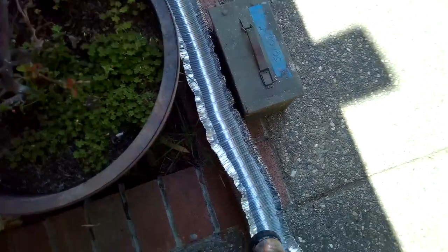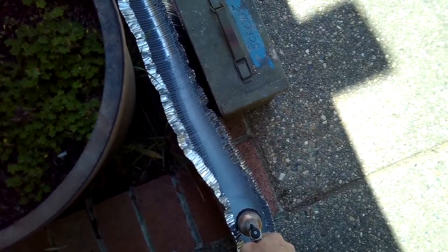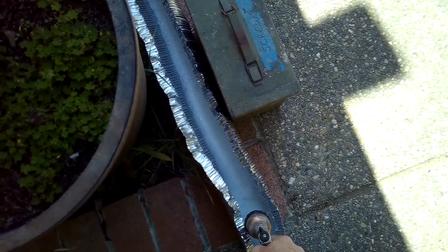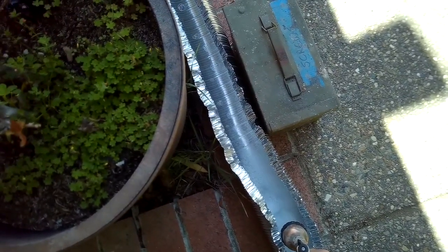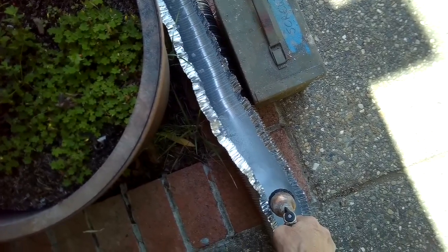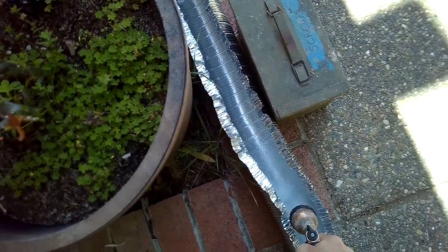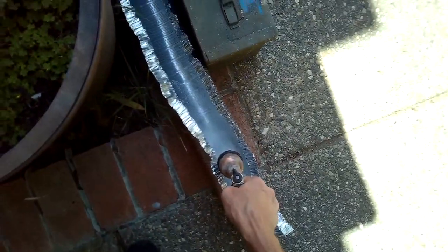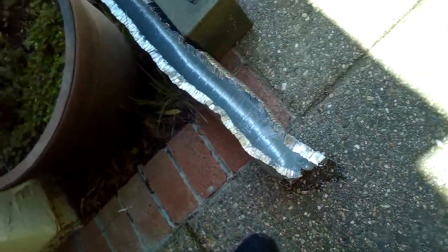I want to see if it'll hold water. I got it suspended between two things and added a little water — let's see if we get any leaks. I'm going to put the blade in mainly to heat treat the ha, or about an inch up on the sharp edge where I'll be sharpening and hardening it. I don't need to fill this all the way with oil — I want to keep the spine and the tang a little softer so they're not brittle, but I need the ha hardened so I can sharpen it. There's a little leak here on one end to address.